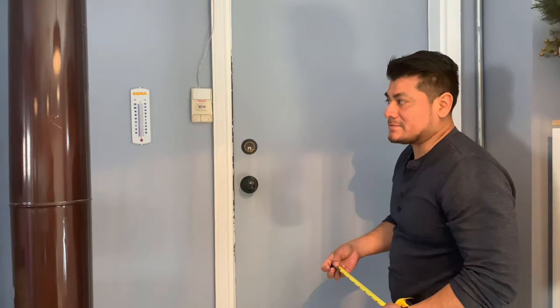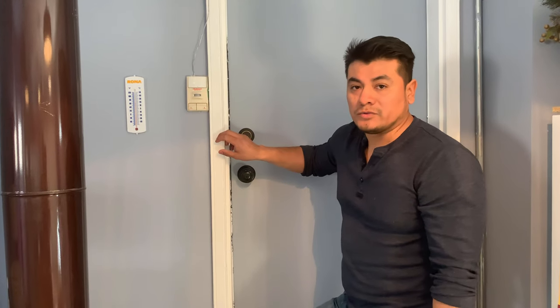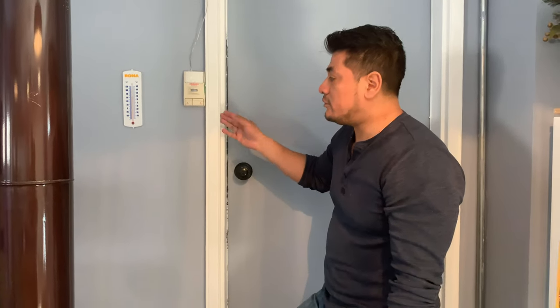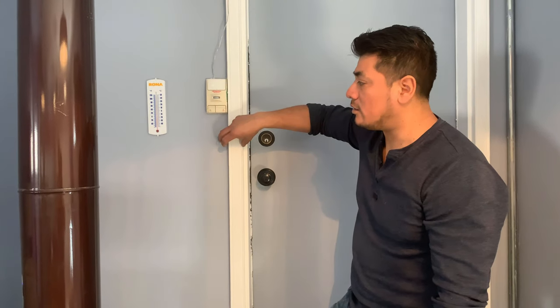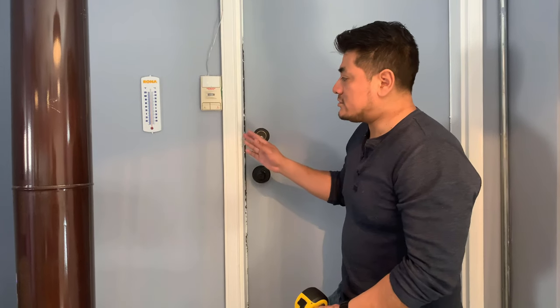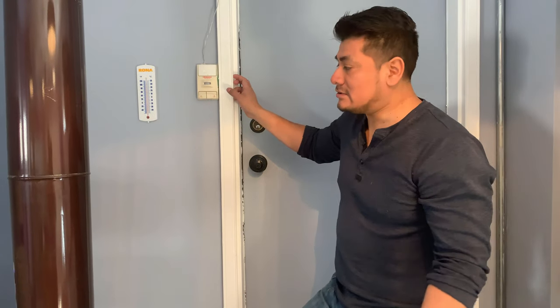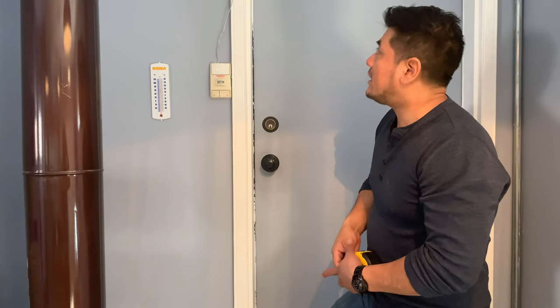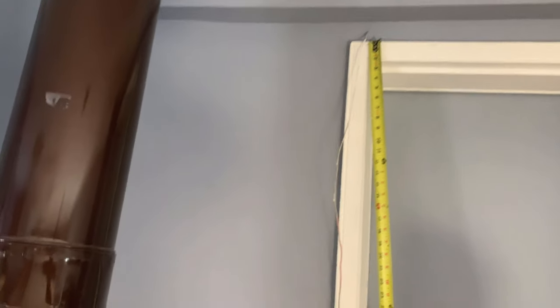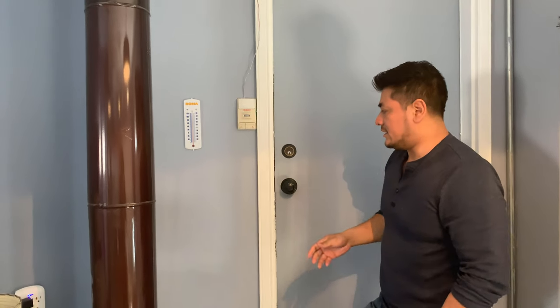We're pretty lucky on this one — we can go with 36 and 1/8. Some are different though, so just make sure you take the smallest measurement. With the brick molding, normally where we work it's usually about two inches, but it's not uncommon to have a much smaller or wider brick molding, or boards, depending on how the exterior trim is finished. We have seen boards that go out beyond six inches, so just be aware of that. For the height, we go from the brick mold top edge to the bottom edge of your sill or threshold — on this one we're at 84 and a half.